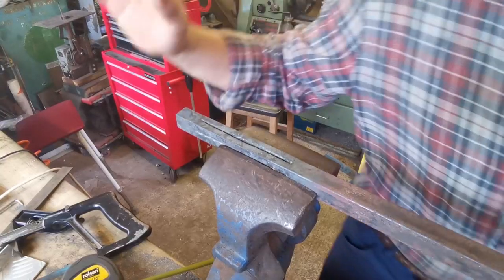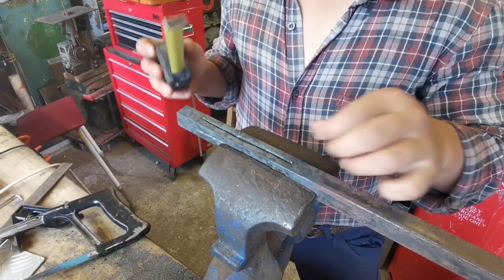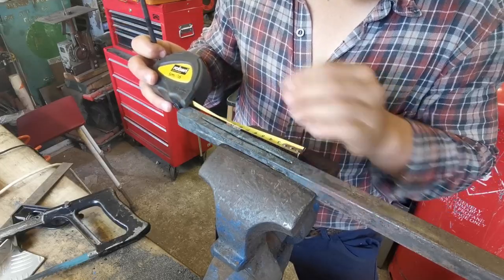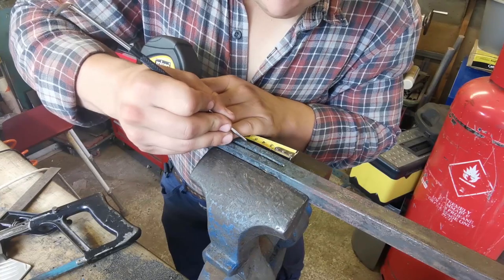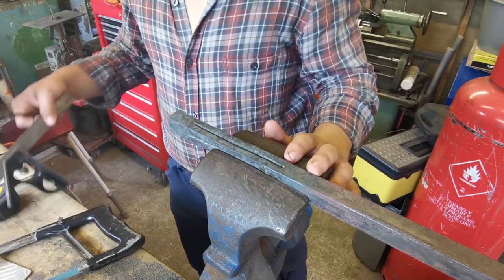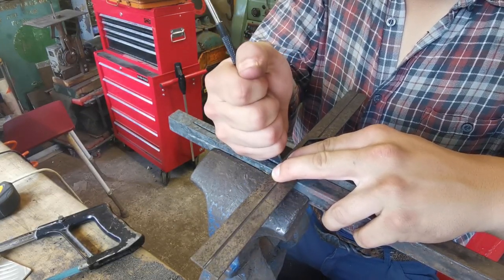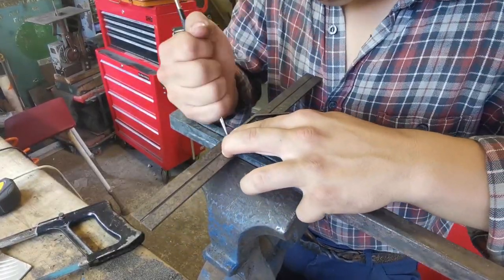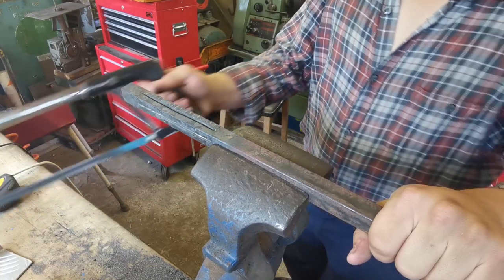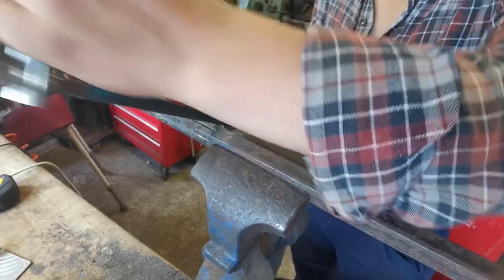And then same on the opposite corner. Right, so I've done a tad bit of working out, and 4.75 divided by 19 apparently is 0.25. So what we're going to do is mark out along here every quarter of an inch. Okay. Now use a set square and just go over each one and make a good solid line. So now that we've marked those all out, we're going to get the hacksaw and we're going to cut those sections.